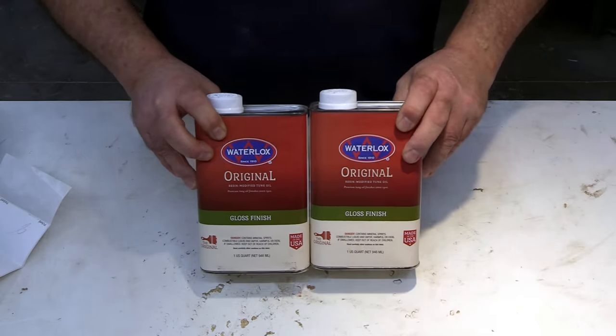There's a big void right down in the very bottom of it too. So anyway, what I'm going to do is use the UV resin from Designer Epoxy. We'll cure this up with a UV light, and then we'll be able to give this one more sanding of 180 and then move on to what we're going to do next. This UV resin is amazing stuff. I'm so glad I've got this now. You could have filled these voids with CA glue, but then you run the risk of maybe getting some air in it. So this is a better option.